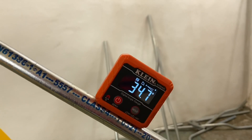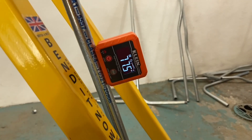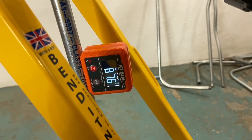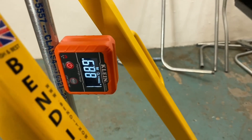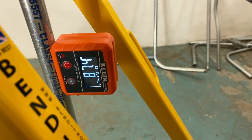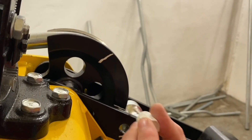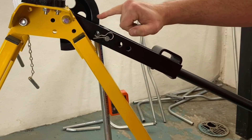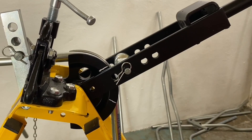When I pull mine down like so and I can see my arm and that white line match, that will be approximately 30 degrees. If you send this on to 90 degrees for me, I can paint myself another line and I won't need your fancy kit. 60, 90 — keep going — almost there, it will spring back. Almost there, mark it — still two degrees out. I think we'll go with that. Just need to paint my second line.